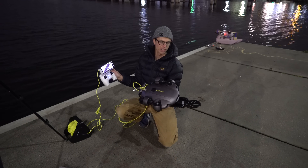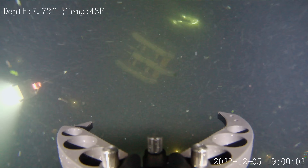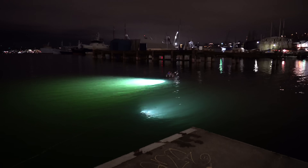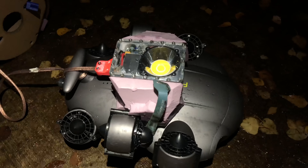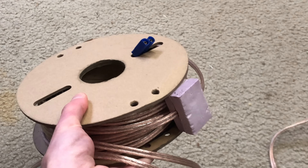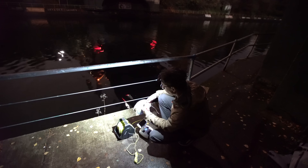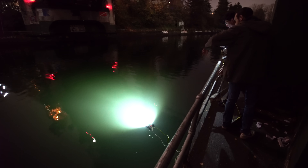I sent the FiFish underwater drone to see what the light looked like from below, and it was not very interesting at all. But maybe putting the light on the submarine would be much better than putting it on a boat — let's give that a try. Since the light itself is negatively buoyant, I had to add some foam to make it neutrally buoyant. I wanted to go much deeper with the sub than the boat winch could go, so I extended the wire by about 40 feet. Due to all the added resistance from the longer wire, the voltage was sagging too much for the light to handle. To fix that, I'm using a big boost converter on the shore that boosts the 24 volts from the 6S LiPo batteries up to 31 volts to send through the wire. The LumiBoost is only rated for 32 volts on the input, so I couldn't go any higher than that. Making a waterproof battery that mounts to the submarine would have been a much better solution, but also a lot more work.